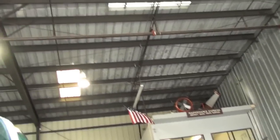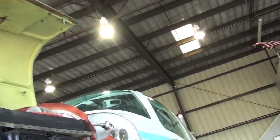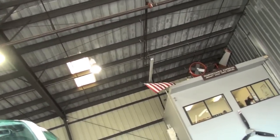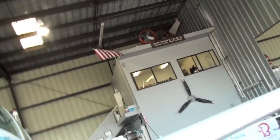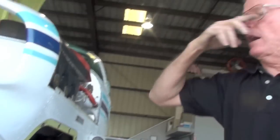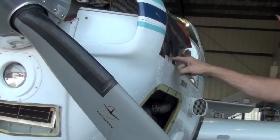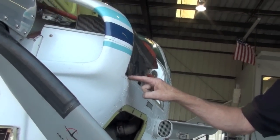And there was another issue. I recently had to replace this, it snapped off. Getting the right adjustment for that closing correctly, and this also being easy to move, was hard, and we haven't really gotten there. There's no trick to it. It's just one of those things you've got to play with. You just keep playing with it. What you want is, when the latch grabs it, you should still have about an eighth to a quarter of an inch.